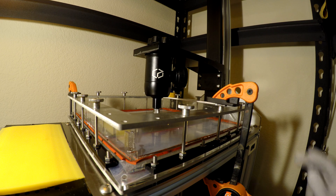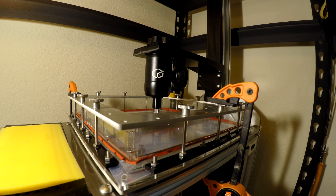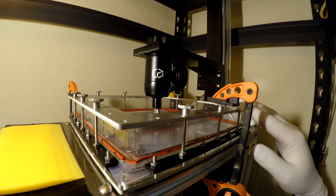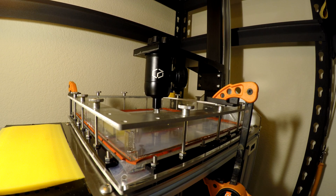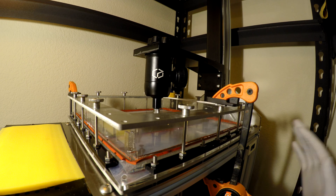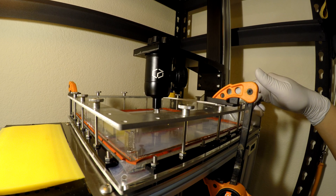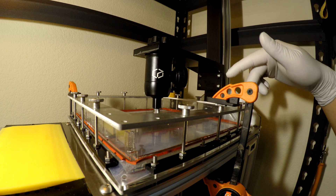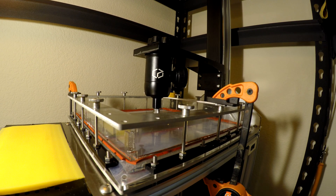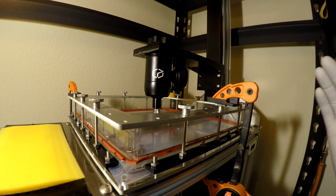My stage is pretty powerful, my vat is pretty rigid, the T-slot frame is pretty rigid and held down strong, so this part here is going to bend a bit. This is where T-Dixon's Kudo 3D specific custom design — which attaches through the normal attachment point and has a plastic-on-metal design so that if there's a lot of flex the plastic part will flex slightly — is good for the Titan One. In this case, if you're going to do a really challenging print you're probably better off with the PSP.